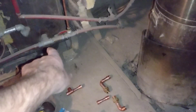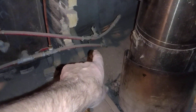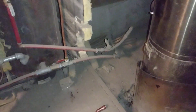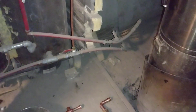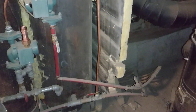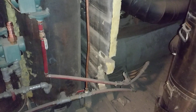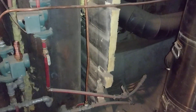I'm going to get the return fixed — it used to stand up but it got the droopsies. The top one helped it stand up but then it jumped its keeper. I need a board on the back and some clips to hold it up rigid. The copper won't have the droopsies — that's the only bad thing about PEX. It's great in walls and for cutting through concrete, but I'd rather have copper.